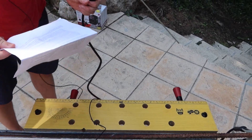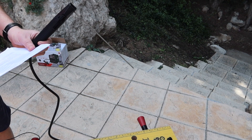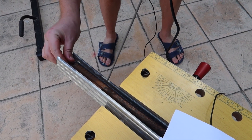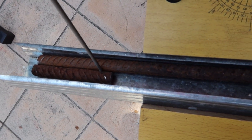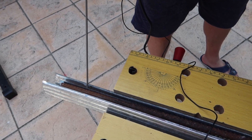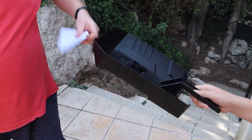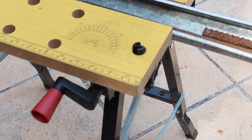We did it. Hold the electrode at a 90-degree angle to the work piece with the tip of the electrode about 2-3 millimeters away from the metal. Strike the arc: press the welding rod against the work piece and strike the arc. Let's weld it. Are we ready? Give me a mask — you can't watch without the mask, your eyes will burn. I'll turn it on. If the amperage is still good enough. Let's try it.